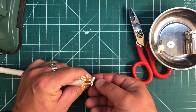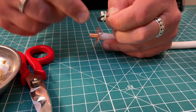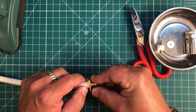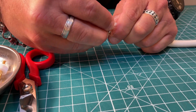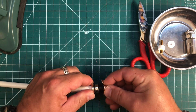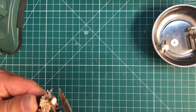The next step is to insert what we'll call the shield connector — you can see there's a groove in it. Sometimes you need to widen it a little bit to allow it to slide over the copper braid, then you can pinch it and it slides right underneath all of that shield. No soldering required. We can then slide the rubber gasket and everything up, and use shears to trim off the excess braid.